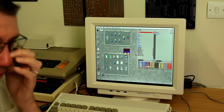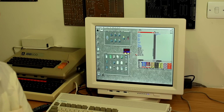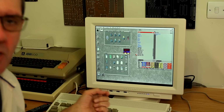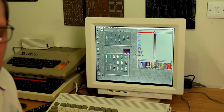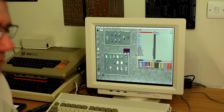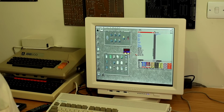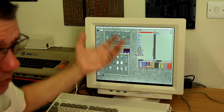Again, if you can live with the way I did it before, which is component but only interlace, and then if you want low res, go into composite, you don't need this GBS board for Amiga people, and that's an awful lot of people. Obviously, then it comes to the fact of Vampire owners or people who've got HDMI and are using the Amiga outputs. You can do that as well.